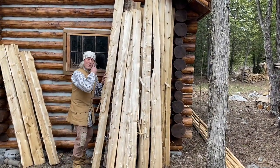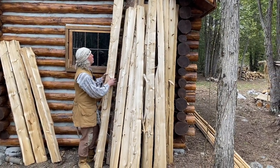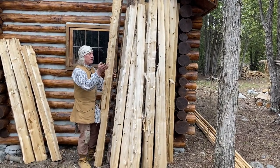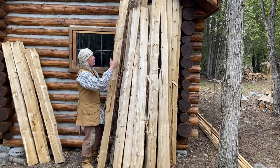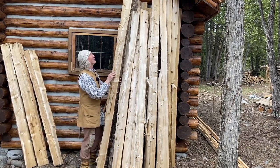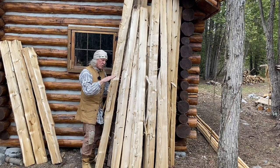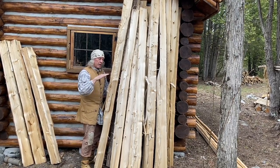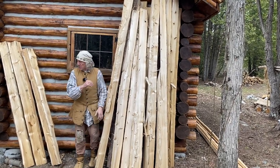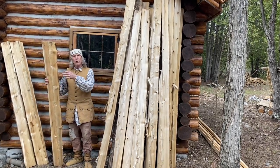So here's where I'm at with the manufacturing of the bits and pieces of a canoe. So the first thing I did was I took my logs and I split them in half, then I split them in quarters. The next thing you saw me doing over there, I'm taking that heartwood out. That's just going to be kindling. Everything's going to get used, and you produce a lot of kindling when you build a birch bark canoe. But those longer pieces are going to go in the center of the canoe. So the sheathing is going to be paper thin, and it runs longitudinally in the canoe, and the ribs cross it at 90 degrees. So the long ones there, and over here, which I've been working on, are some of the shorter ones, and they're going to go in the bow and the stern.